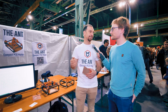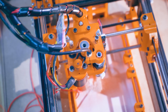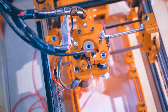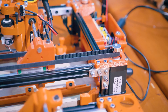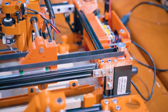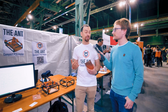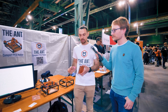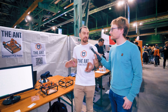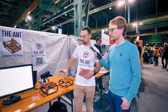The mechanical designer on the team designed this machine to be scalable. We're using Maker Beam frames, so if you want to make it wider, you don't have to redesign the 3D printed parts — you just use a longer beam and you're good. You can also change the dimensions, though if you change the side where there's a rail, you'd need a larger rail to match.